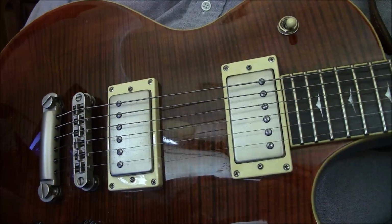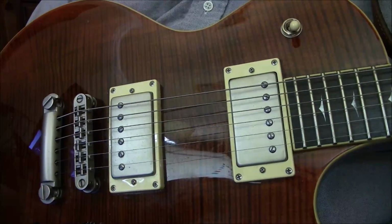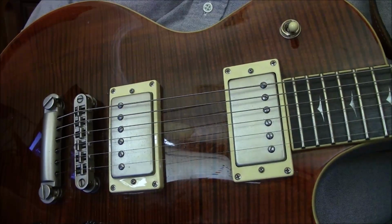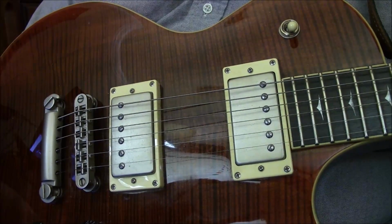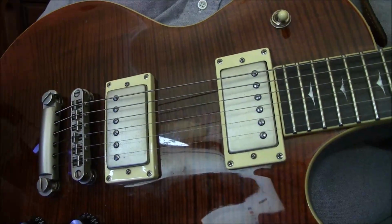Next, check to see if it's got a two-prong cord. If it's not grounded, especially the older amps from the 50s and 60s, that's going to cost you a minimum to repair. Get rid of that old death cap in there and put a grounded cord on it. There's your first charge, right?